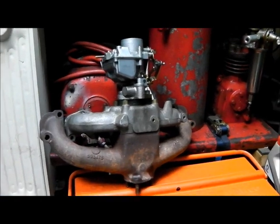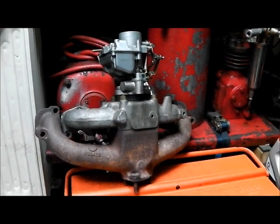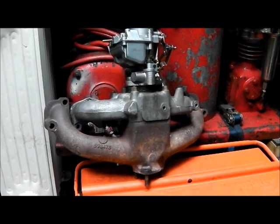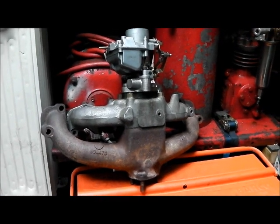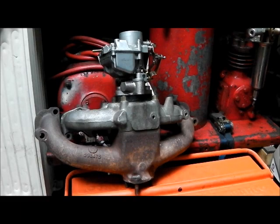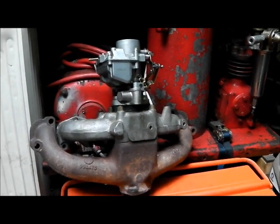Well, that seems to have been something of a success. Obviously it's far from finished yet — there are a few bits to tidy up, like the heating pipework for the carburetor manifold, and the exhaust still needs to be done. I think the only thing that was really difficult was the throttle mechanism — that really took some setting up, a lot of thought and tinkering about until I got it right.